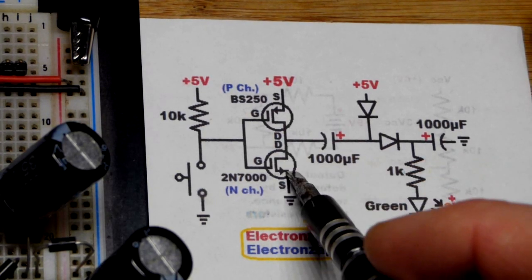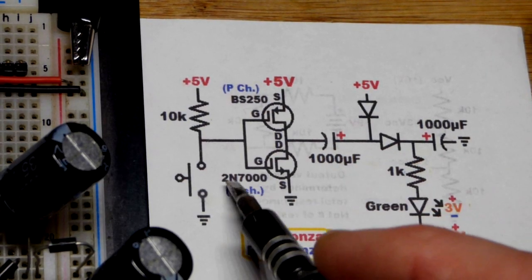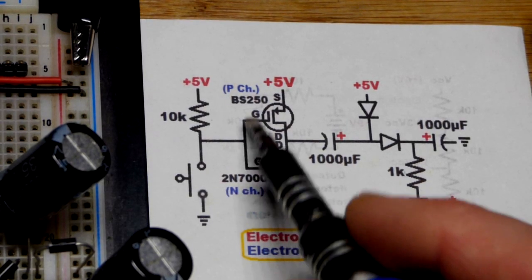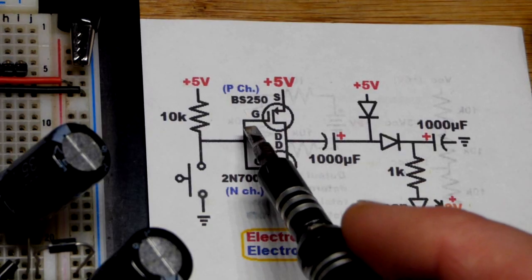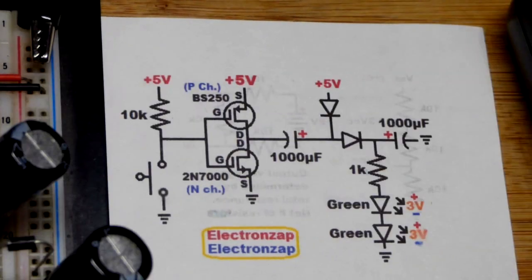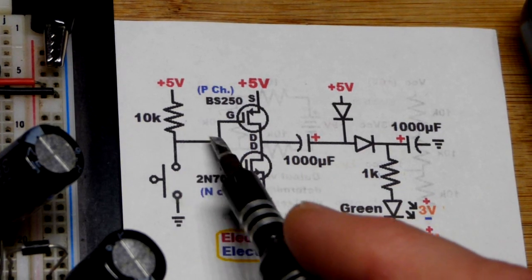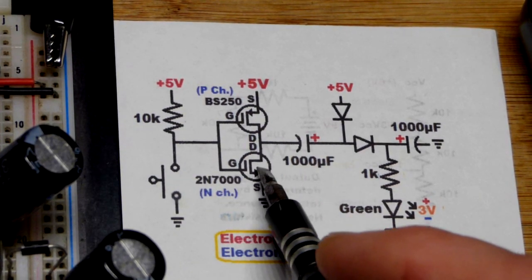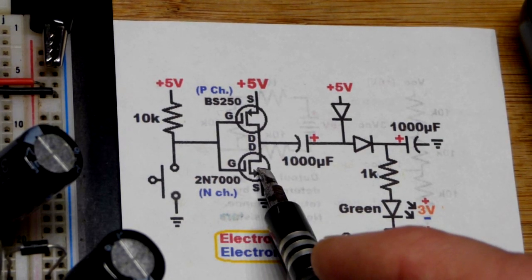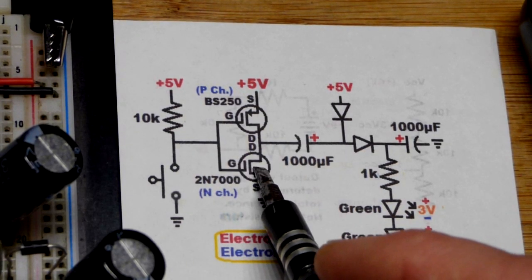Now we come to the schematic to look at that transistor setup. The P-channel enhancement mode MOSFET is the BS-250, and the N-channel enhancement mode MOSFET is the 2N7000. You just give the gates a voltage — they don't really rely on current, although they're kind of like capacitors. Current briefly moves but practically none. You give a voltage to both gates at the same time because they're connected together, so it's like a NOT gate. If you have a high enough voltage, that turns the N-channel on. N-channel is more positive, P-channel is more negative — they're opposites. It turns the P-channel off because it wants a more negative signal to turn on.